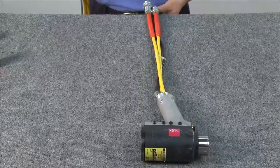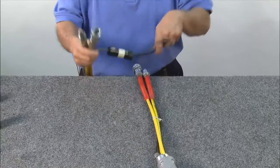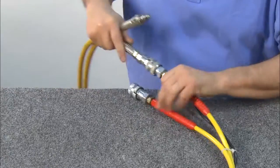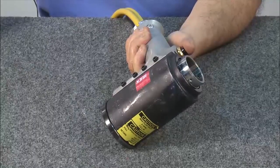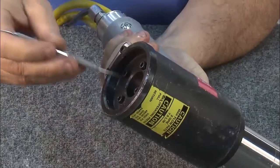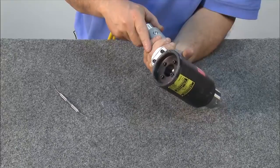Next, check for hydraulic leaks by hooking the tool up to the power rig. Plug in the electrical connector and plug in the disconnects. If hoses or electrical connections show wear, refer to the manual for replacement. Now we're ready to cycle the tool and check for leaks, checking the front and back of the tool carefully. Once you're confident there are no leaks, you're ready to install the anvil and puller.